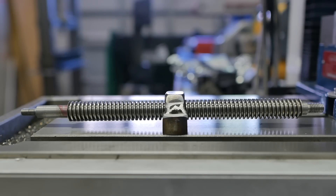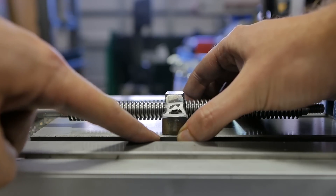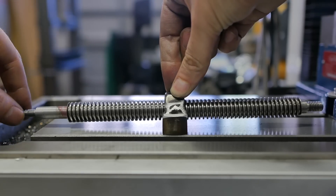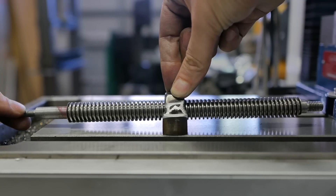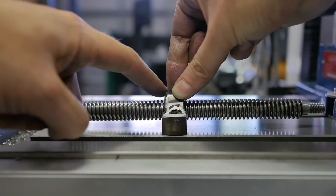Here's a bit of a problem I'm running into — as a matter of fact, this was a problem the first time I put this together and I was kind of hoping the mill would solve it. What I did was I used this top of the nut as a reference and milled this parallel to that. Unfortunately, that nut is really not a good reference because you can see this guy, even though it's got some play in it, it's leaning more towards this end. So I'm gonna have to find a way to rig this up in the mill, find the exact center of this play, and mill that flat according to that — not this top surface.